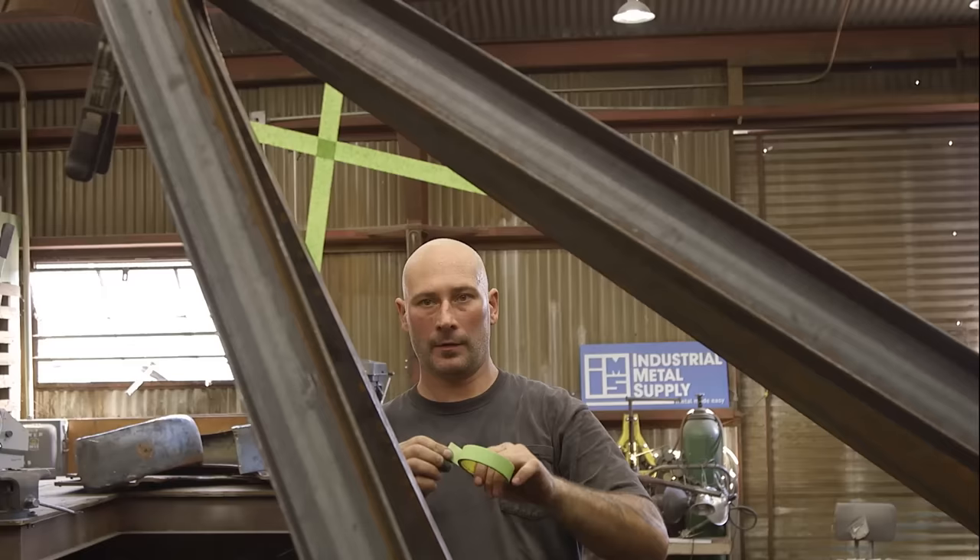What I just accomplished was just getting a preliminary setup on these dimensions. Don's parts pile is ever flowing — he brought in these old running boards. There are a number of problems: we're way short in our reach from front to rear. This fender is a similar year to this body, so what they would have is like this little apron, this splash panel, and the running board at this height. But that fender is much lower, which brings the running board way lower. This is where it's really at with this project — taking these mismatched parts and making the side profile of the truck one cohesive line. I've got to nail it.